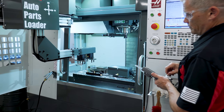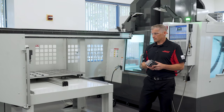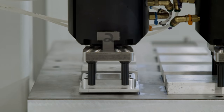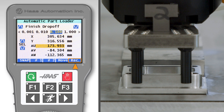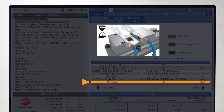Like before, we'll jog the arm to outside the enclosure and close the doors. Now let's set our table drop-off location. We can push Move to get the arm back home quickly. We'll jog AU, AV, and AW to line up the part — now held in gripper number two — just above its empty space on the template. The drop-off pocket is the same one where you picked up the part earlier. We recommend dropping the part off at about 50 thou or one to two millimeters above the table. We've reached our drop-off location, so we'll set this position by pressing record on the RJH or F2 on the control. With that set, I'll unclamp the part by pressing number two, then move AW upwards to mid-level. The last line on this tab is air dwell time — the duration of the air blast for cleaning the vise jaws. We recommend leaving this set to two seconds unless you find you need more cleaning.